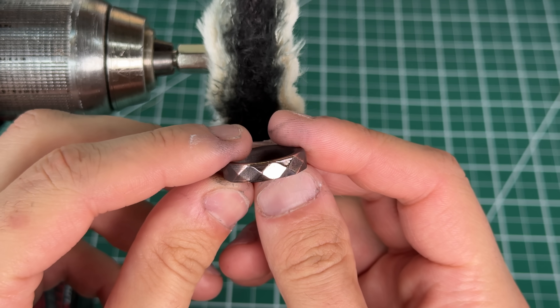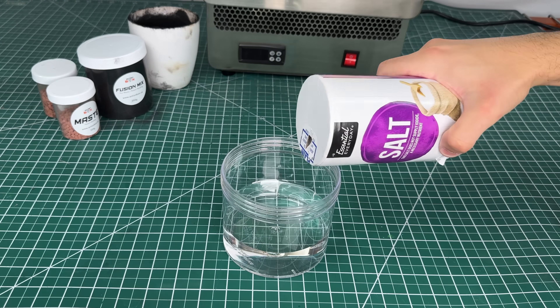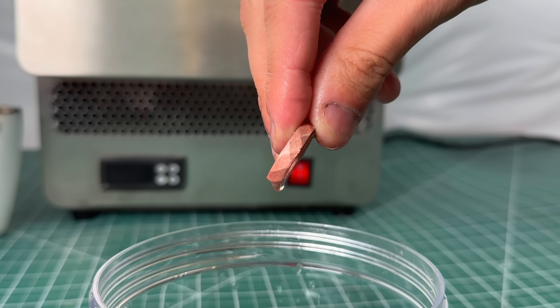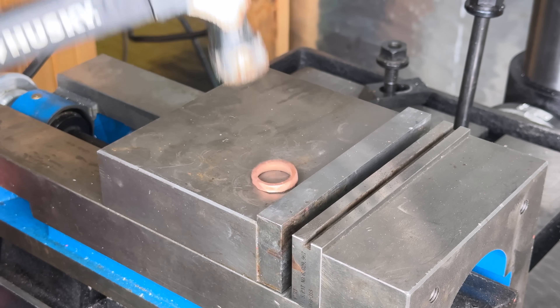Once we take the part from the crucible, it's dirty, so we rinse it in water and then use a brass or steel brush to get a nicer finish. A buffing wheel works even better, but here's a neat trick: pour some white vinegar into a cup and add some salt — the proportions don't really matter. Then place the finished part inside, and after a few minutes you get a piece that looks like pure elemental copper. And yes, these are super strong parts.